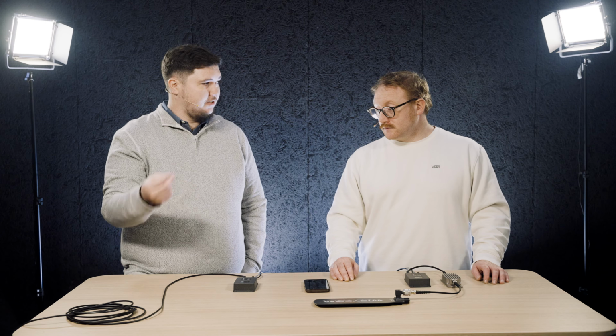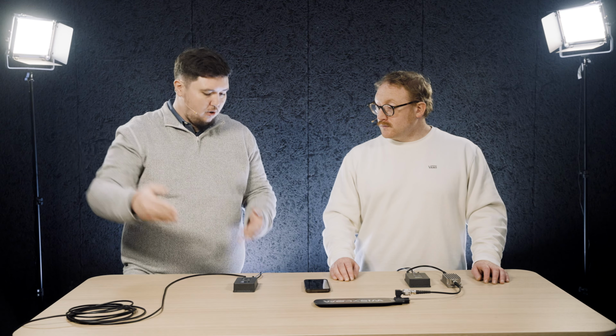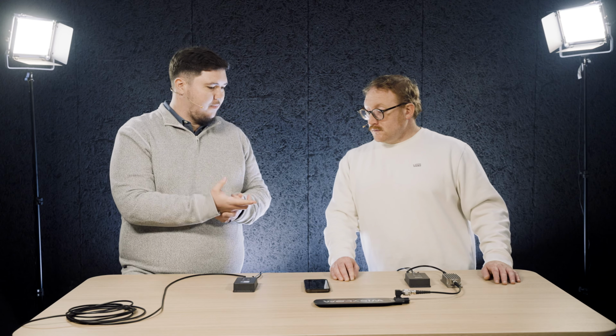But in all of this, you come to a new question: in my legacy system, perhaps I can't use multiple transmit antennas because I've had issues with phasing and all these other things. But with the Wisycom MTK, we use a technology called direct digital synthesis. What this does is, in the transmit carrier, it has a clocking built in. So as you split antennas, whether it be your local zone or you add fibers and do optical splits and all these other things, the belt pack, the MPR50, will always see the transmit as one fully synchronous carrier as you walk from zone to zone.